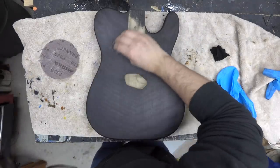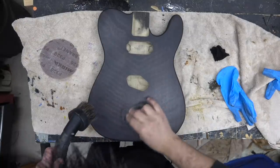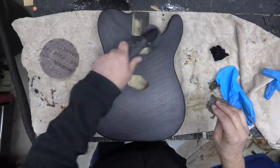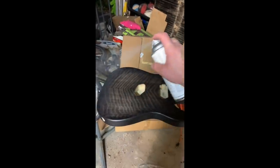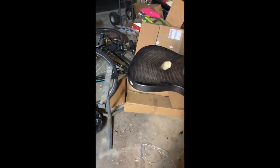We get some fine grade steel wool and begin to rub out the black. This is the trick to get the dye off the top of the wood, not in the wood. The fine grade steel wool helps pull that out and you get the figure and the grain lines — this is what I call getting the top to pop. You got to do this and take that little bit of dye out; it makes a huge difference. I'm vacuuming up as I do this. We're then going to do four coats of Mohawk pre-catalyzed sanding sealer. This helps lock in the color, and you can put on whatever finish you want after — a heavy 2K, a light true oil. This way you don't get a mess.